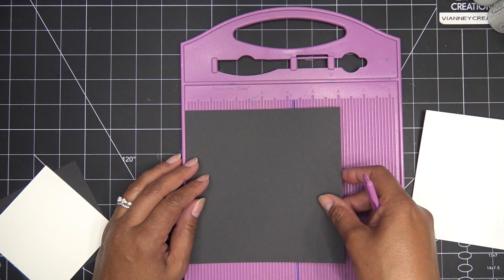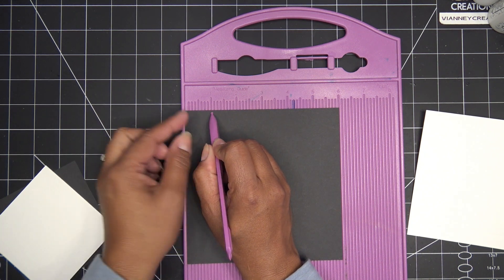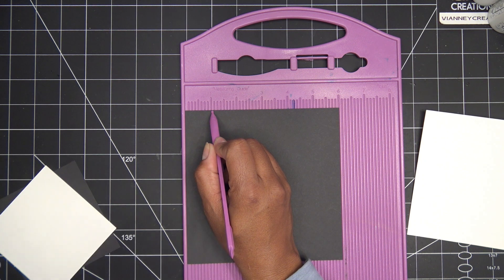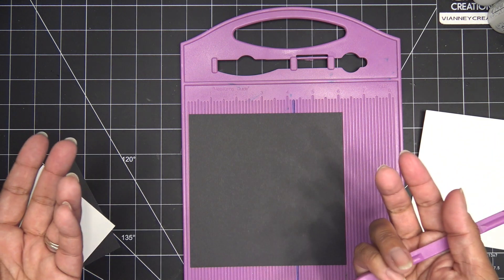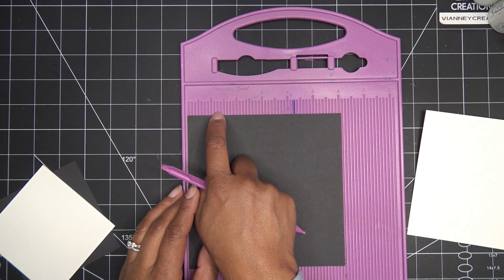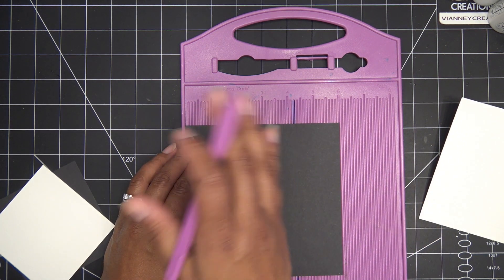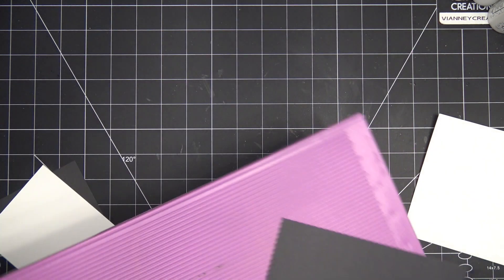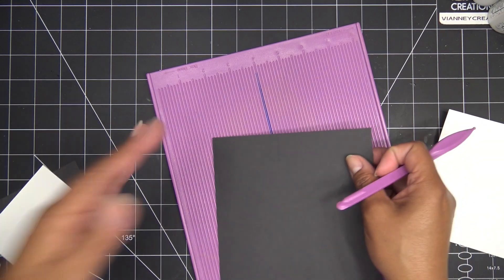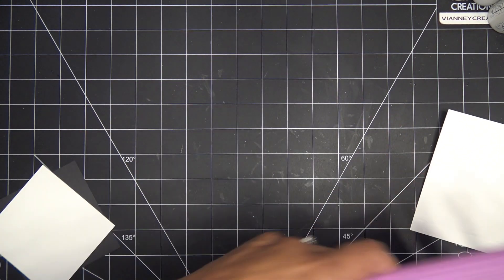Your score line for the base just needs to be a hair more all around. When I turn this to score one inch, the board is already accounting for that little extra — you can see it's like one and one-sixteenth, between the actual one inch and the eighth. You can kind of move it over and eyeball it. I'm scoring one inch because I want my base depth to be one inch.